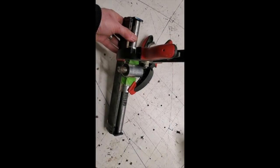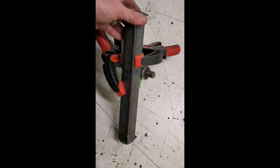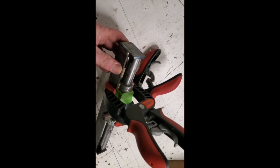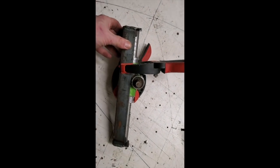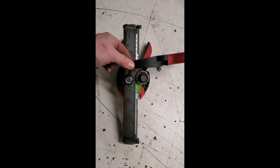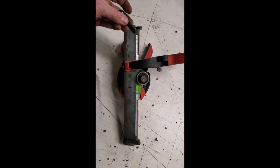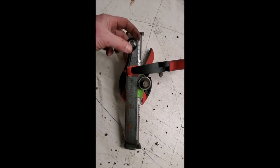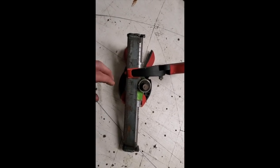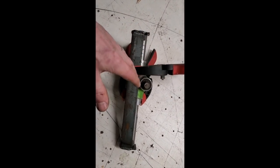This is my old rack and pinion steering that came off my old trike. I took some angle iron steel and welded on some ends. What I'll end up doing is putting some tabs right in the center where the tie joints will attach to connect to the steering arm on both sides. Basically I'm just lengthening the actual steering rod, and that'll help make less toe-in and toe-out when you go into hitting a bump or jounce as they call it.